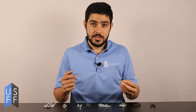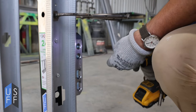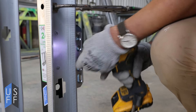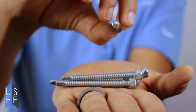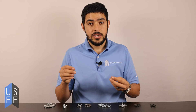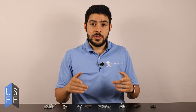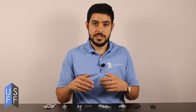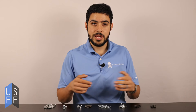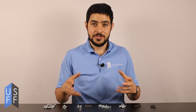There are a few different driving methods for screws. Most screws that need to go flush are Phillips heads, which allows them to sit more flush than a hex head. Hex heads don't tend to strip out, compared to Phillips heads which can break bits and strip out very easily — so hex heads are preferred where you don't need to be flush. If you need help choosing the right screw for your job, go to our website for an article detailing all the different applications. You can also buy screws at usframefactory.com along with other accessories for your metal stud construction work.